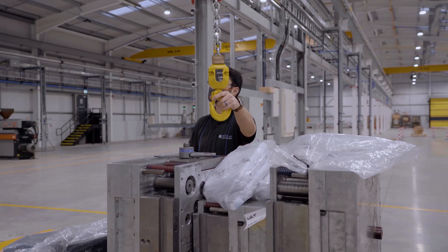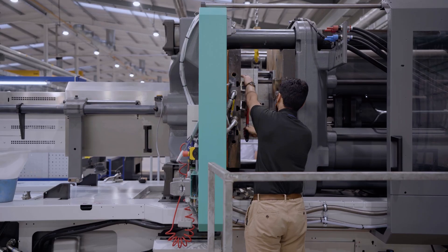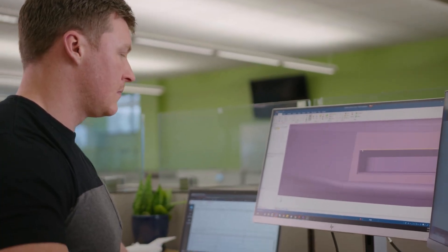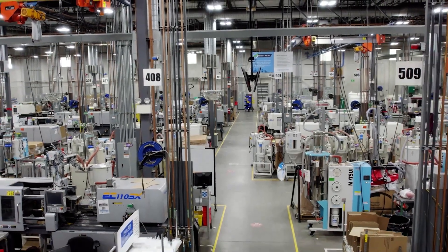Let's break down some key benefits of aluminium molds. Aluminium tooling has several advantages: molds begin around $1,500 and can be delivered in seven days or less. Steel tooling, comparatively, has a larger lead time. Aluminium tooling produces production quantities of at least 10,000 parts, but often much more. At Protolabs, customers can choose either prototyping or on-demand production for quantities and corresponding price point to fit their needs.